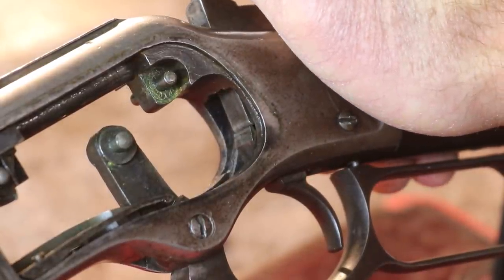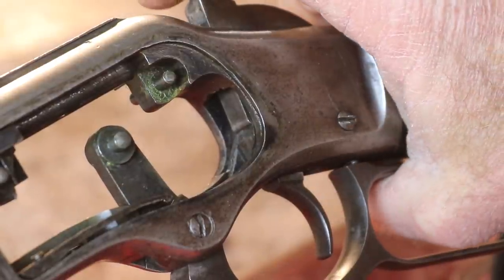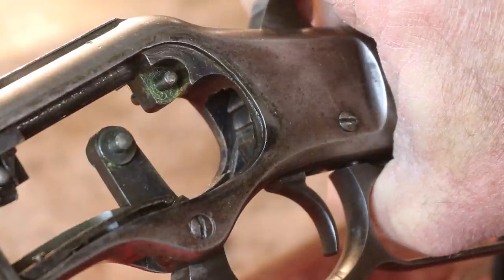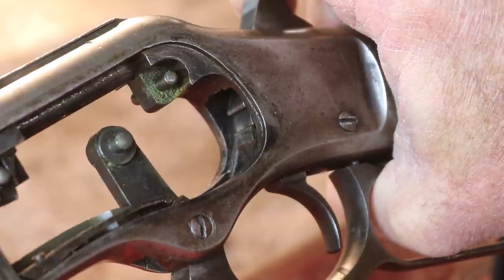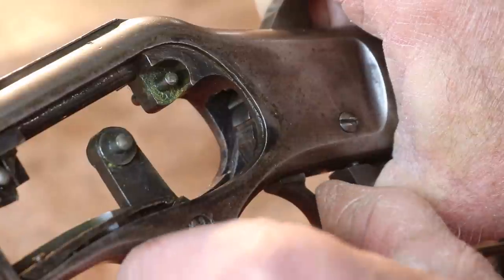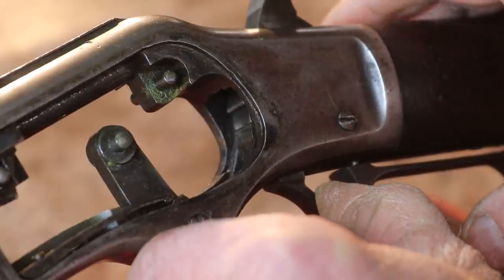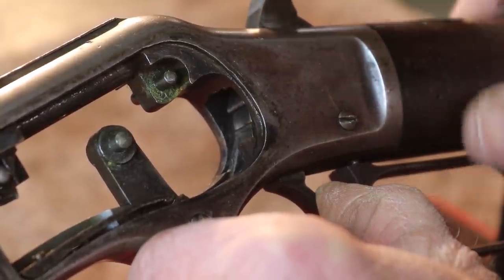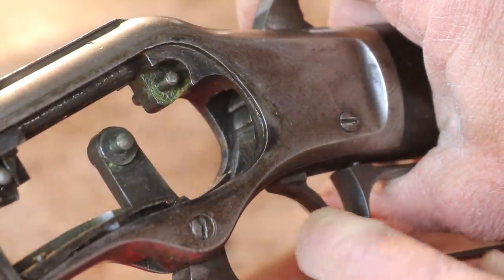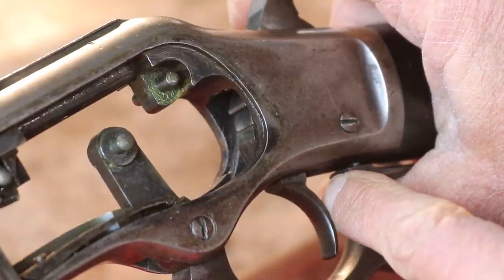Let's pull back on the hammer - we've dropped into the half cock notch, seems to be working properly. Let's go on back to the full cock notch, and there we can see the sear just riding over that notch. It is really really shallow - somebody has worked back the face of that full cock notch a little bit. We've also probably got an issue with the sear spring or trigger spring, because if we pull forward on that trigger then it stays in the notch where it's supposed to. So it's either weak or broken. It looks like we've got some rounding on both the hammer's full cock notch and the sear top, so we're going to have to clean those up, stone those, and get them back in shape.